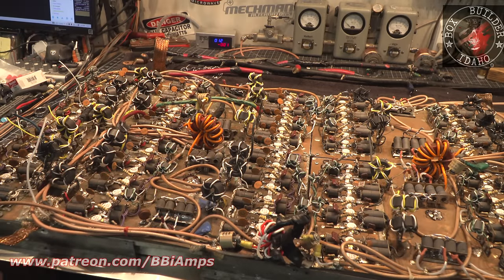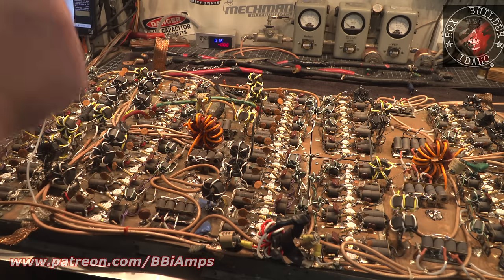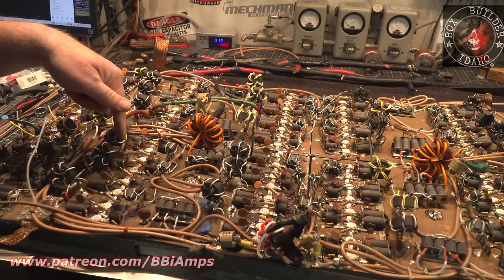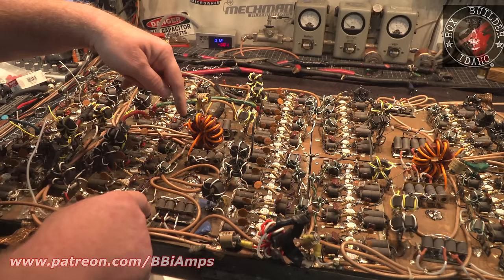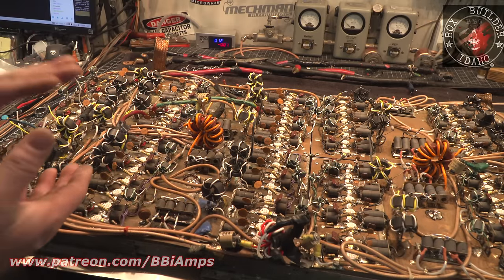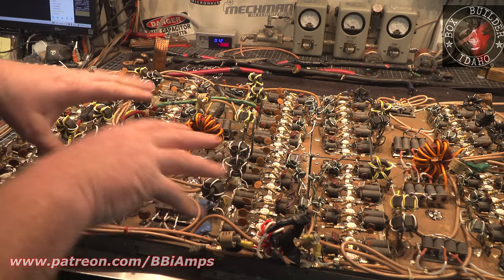So when you start seeing this, that tells me that for the outlying components there's not enough board capture where you've got screws going through to the aluminum metal mass that's then in turn carrying the ground current to the top side for the transistors. There should be, in theory, in between each one of these output transformers, a screw that goes to the heatsink. And that one little screw over that tiny little distance can carry a huge amount of amps. Well, in this particular design, we have screws on the outside corners. We have one here. We have another set, usually somewhere in here, and then we'll have another set on the outside ends. There's not enough surface tension, enough metal mass between the heat sink and the board to carry enough current to each one of these transistors.